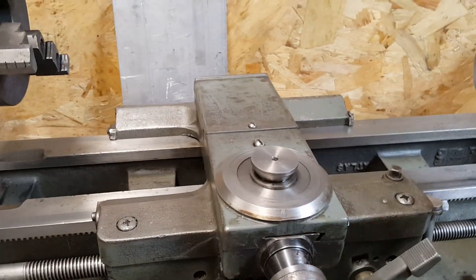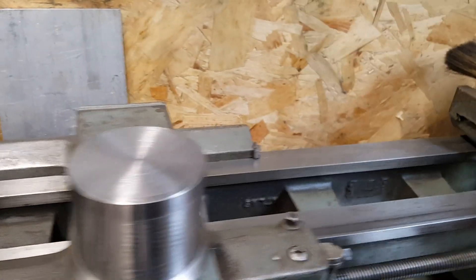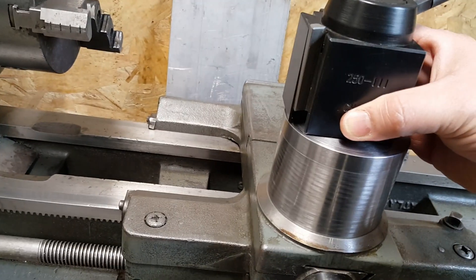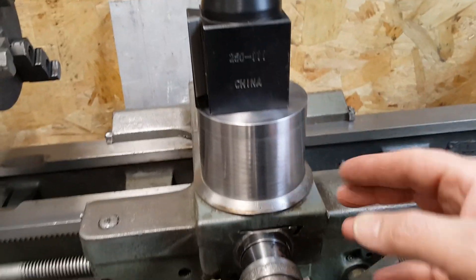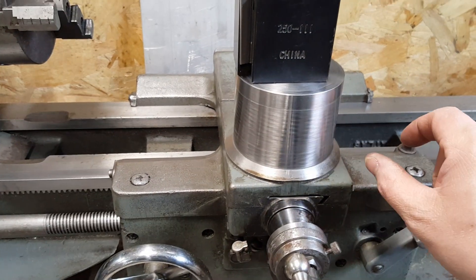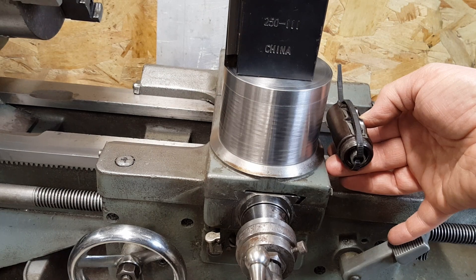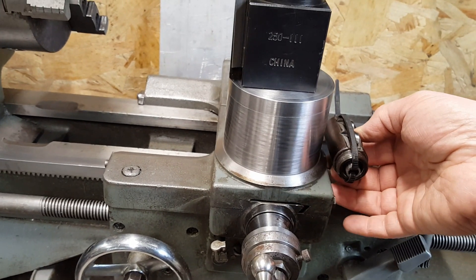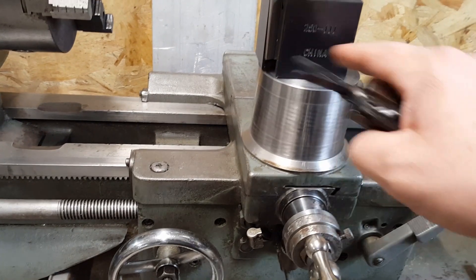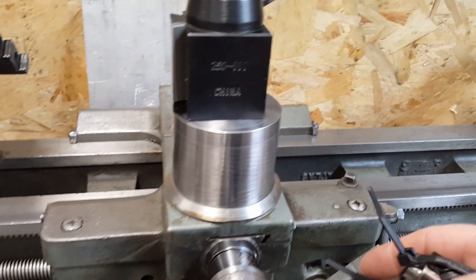The adapter is turned and ready. The tool post is going to mount on here roughly like so, and I plan to machine a flat on the back side with probably four holes and a bracket that will come over to hold the ball nut for the screw. I may have to machine some clearance on there — I want to keep it up as close as I can. Once I get that machined, I'll put in a tap here and a tap there to lock it in place on the post.